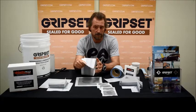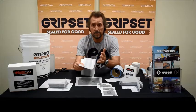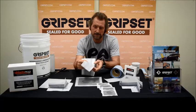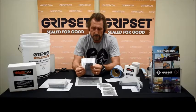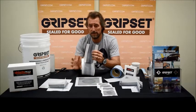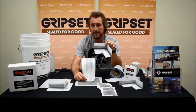It's instant — it's already waterproof — and from there we can incorporate all our systems, whether it be our external liquid membranes, membranes for immersed areas like swimming pools and water tanks, underground areas like retaining walls, planter boxes, or even our GC system mentioned in the last episode. The Elastoproof joint band is a critical part of our systems and we use it across everything we do.